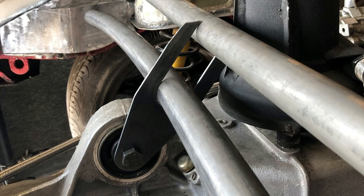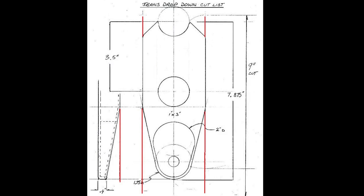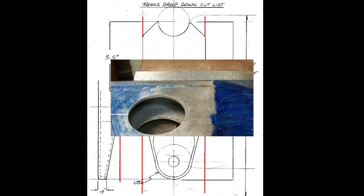Next, I drew up and cut a dimensionally accurate plate that would give us an exact location for everything and provide a basis from which we could draw accurate dimensional drawings to make the final parts. Here's the final drawing — the red lines indicate where pie cuts were made and those surfaces folded down to create the shape of the hanger. The lower portions are drawn long and they actually wrap all the way around, fully seam welded to make this beautiful lower portion of the part.